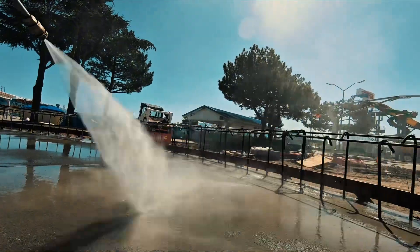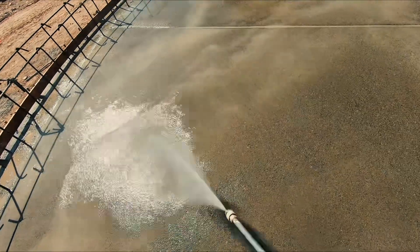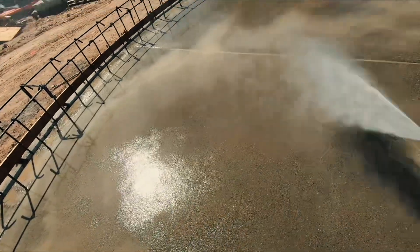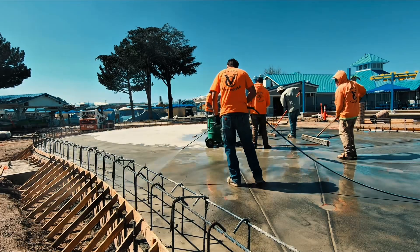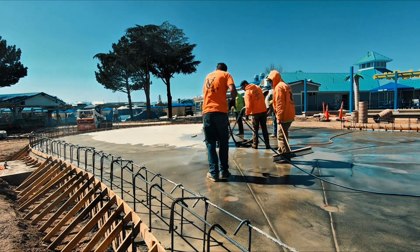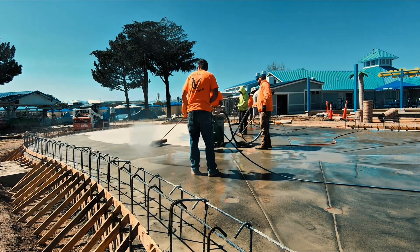You want a nice consistent, even pattern so you don't see streaking. Keep it moving — if you keep the pressure washer up higher, you can always go a little more but you can't go less. Pay attention to the streaking; it's hard when you've got this many guys. Watch for footprints. When you're troweling, make sure you're not leaving lines, because those lines will show up — joiner marks will show up, kneeboard marks will show up. You've got to lay it down real nice because it'll all mirror through.